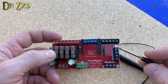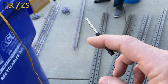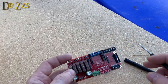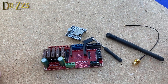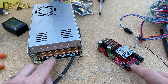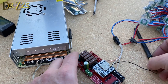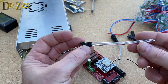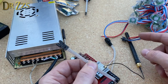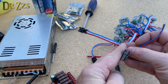We're going to do the smart thing, which is wire up the controller in a test rig on the ground so that we can test every one of these strings of LEDs before we put them up on the roof. Because what you don't want to do is put them all up, turn them on, and not have anything work — that's about as frustrating a thing as you could possibly run into. So the test rig is wired up. We've got our 12-volt power supply, a positive and negative going to the input side of the controller. On the output side, I put one of these connectors so that we could easily connect and disconnect a string. You can also cut the last connector off the very last string if you want.